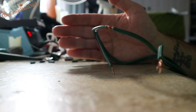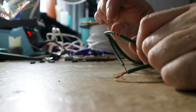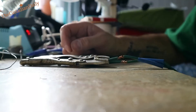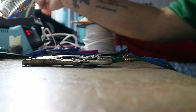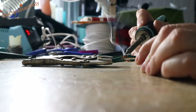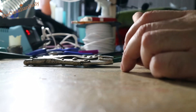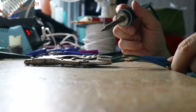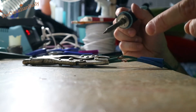Do both of them, then solder them to get a nice solid piece. But before you do that — and I have to take this one apart because I forgot — slip a little piece of heat shrink tubing over the top first. Then you heat that up and it looks good as new. Now, a little trick I learned — kind of embarrassing to admit — I've been in electronics for years, electronics engineering background from college, and I learned from a YouTube channel called D. Higginbotham.